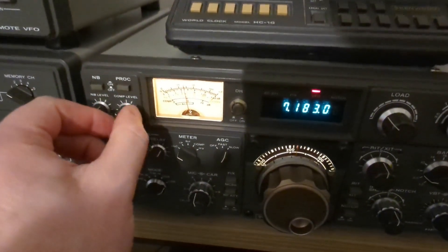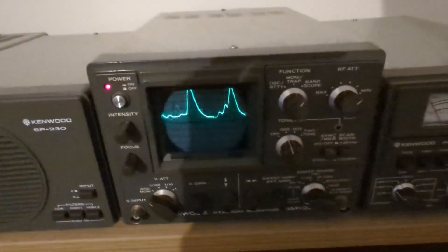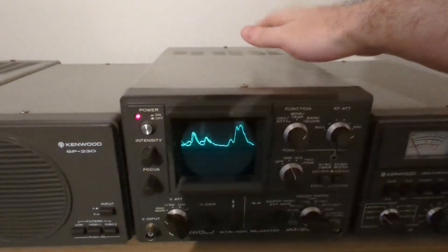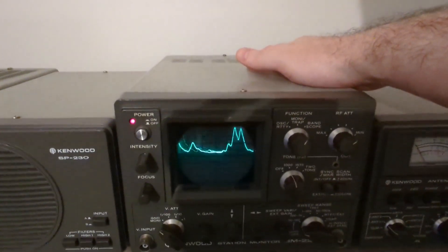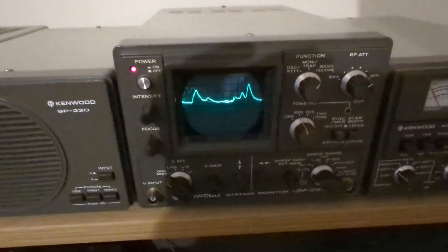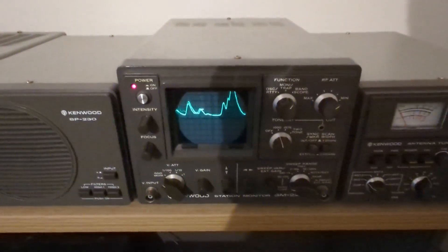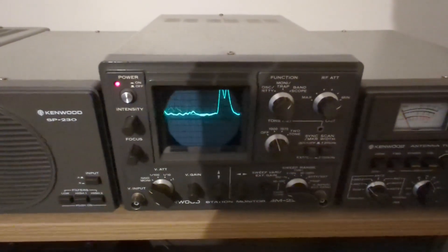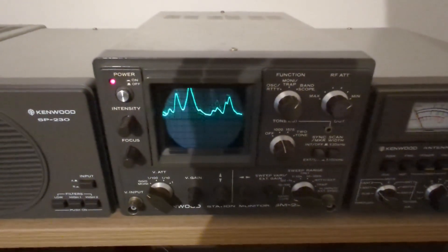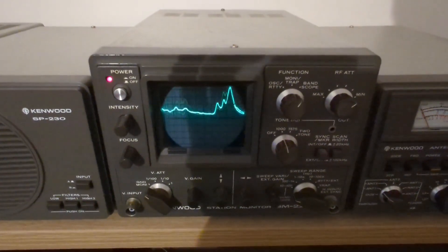Lessons learnt on the SM220 station monitor - common fail points: oil-filled capacitors, the nylon shaft couplers and their breaking, and sadly buyer beware still applies, but that's okay. I do have a list of people I shall never deal with again. 73s from VK3 USA, VK2 XXL - fixing what other people are too lazy, or lack the basic electronic knowledge, to do themselves.